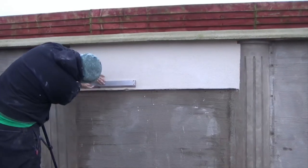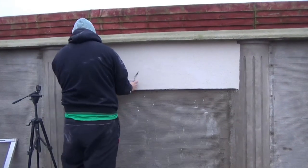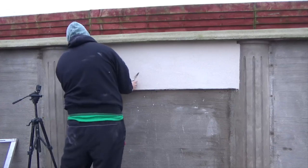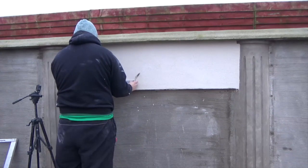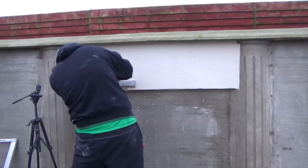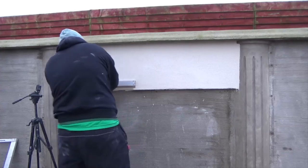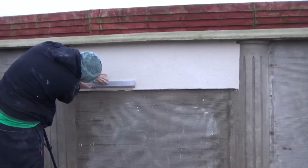So along the bottom here, I'm just cutting in the slope at the bottom, and that's going to allow for me to do another V coming up to meet this one. That's another project, another demonstration for you guys, so you'll have to subscribe to see that. And what better tool to use than the Rambo base cutter, which has a level on it. Again, you've got to get these lines as level as possible, as the next one will show it up. If one's level and one's not level, they'll really show each other off as being a bit of a poor job. So you want to take your time and cut something like this, and make sure you get it right.